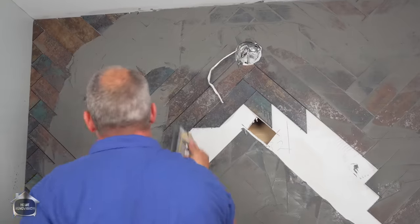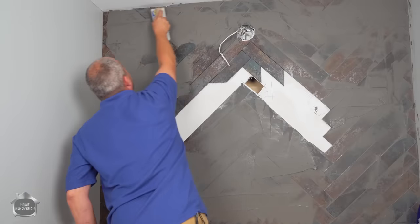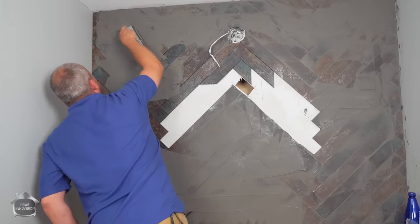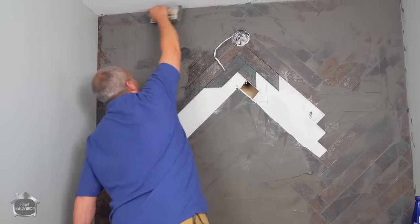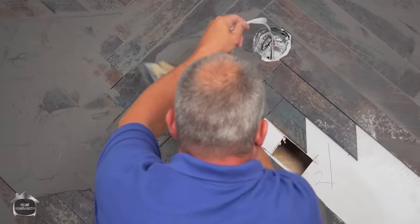when you're using that process. I just found when you add white silicone onto a white ceiling, it looks like trash because the ceiling is a flat white, the silicone is a shiny white. So using the clear silicone instead of the white just gives you a better look. It makes the tile work the star. It doesn't draw attention to itself.